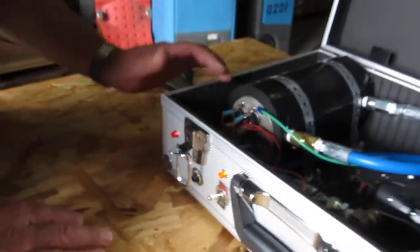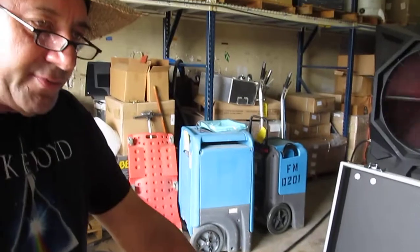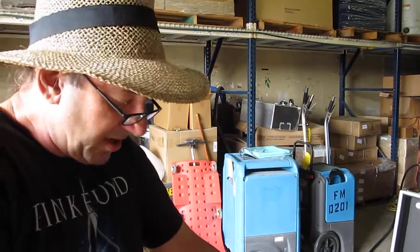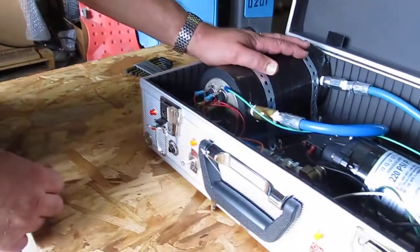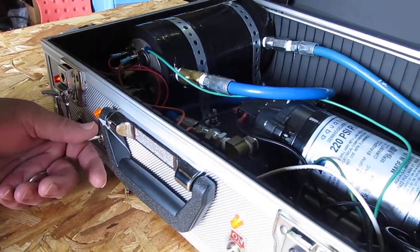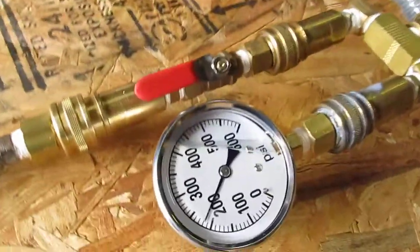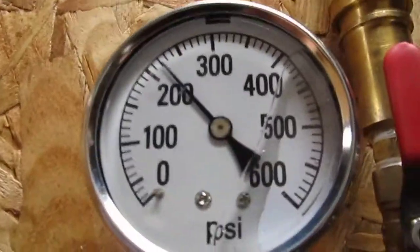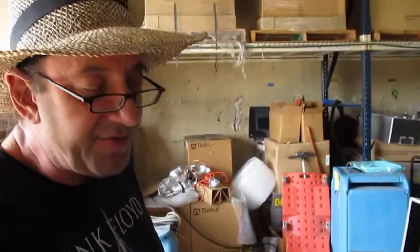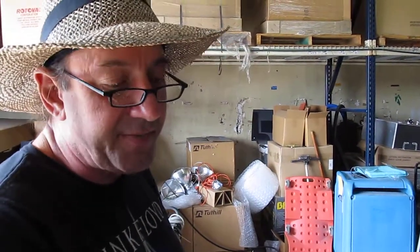These lights will cycle on and off with the heating rods. If it sits long enough with water moving slowly enough, it reaches somewhere just shy of 200 degrees — one element clicks off just under 200 and the other just over 200. At 220 psi, the pump doesn't cycle because the pressure switch is set at 250. But if you have inbound pressure higher than 50 psi, it will probably cycle through a number-two tip. Going to a number-three or four tip will stop that cycling.